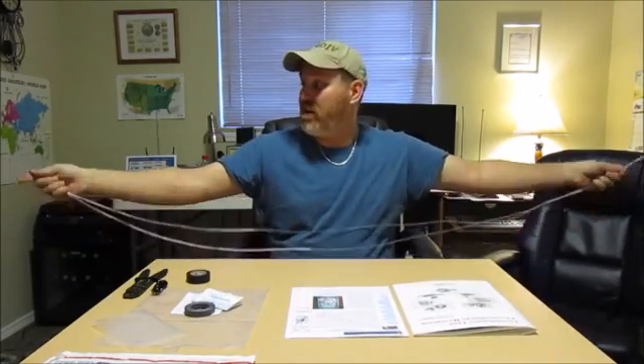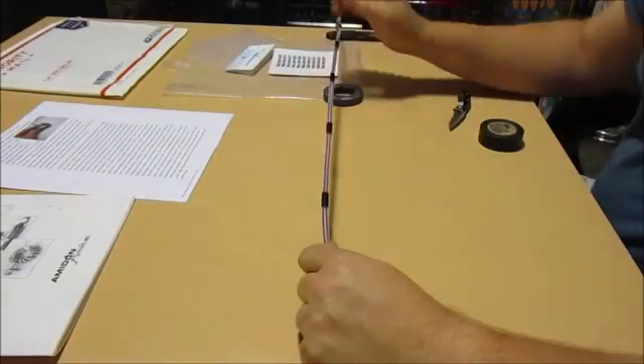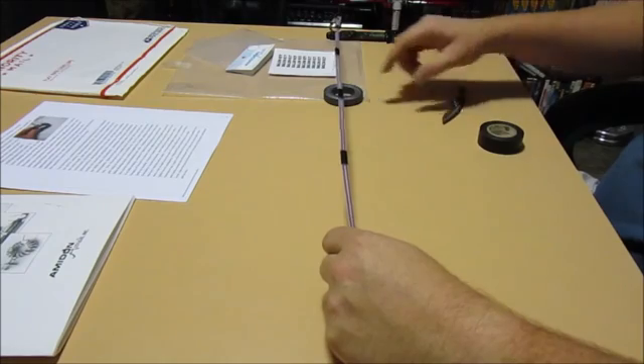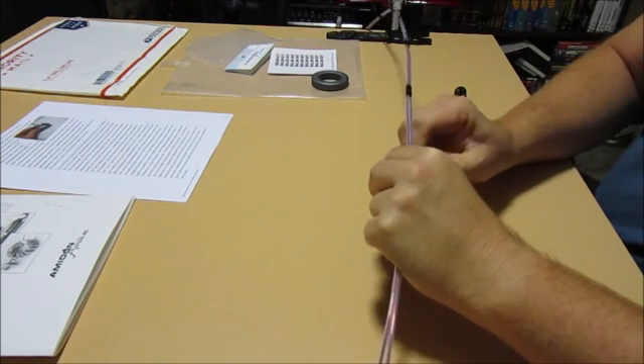What I've already done is taken my length of wire, folded it over, and cut it at the halfway mark. We've got to wind our coil around this toroid doughnut here with a double winding, so I had to cut it in half to do that. Every few inches down this double winding — they call it a bifilar winding — I'm placing a little bit of electrical tape just to keep the wires together.